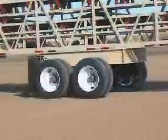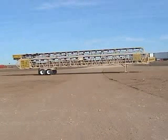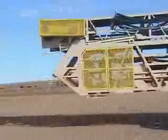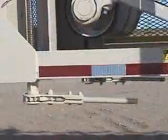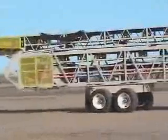The Fisher Overland Telescoping Conveyor is designed to operate at 1,000 tons per hour at 450 feet per minute. It has dual 25-horsepower electric motors with Dodge shaft-mounted speed reducers and V-belt drives. The conveyor incorporates two take-up systems. A ratchet-adjustable gravity take-up is located on the main truss body. The tail end uses a screw-type take-up.